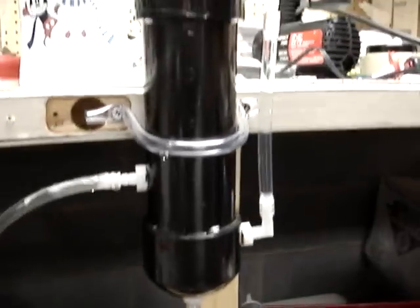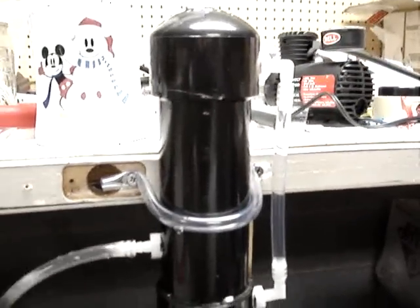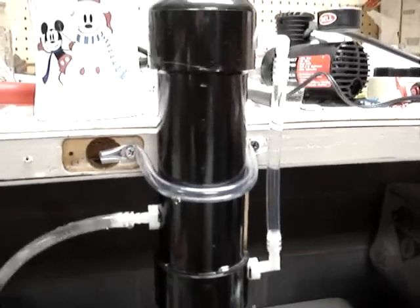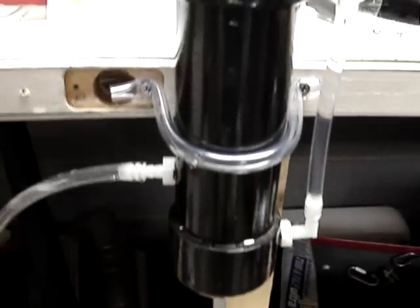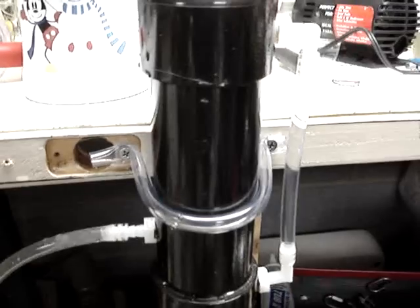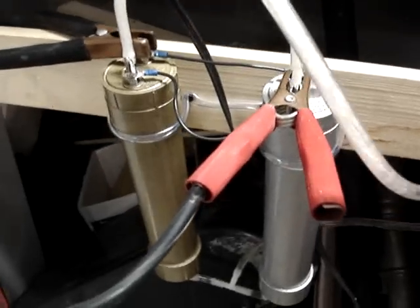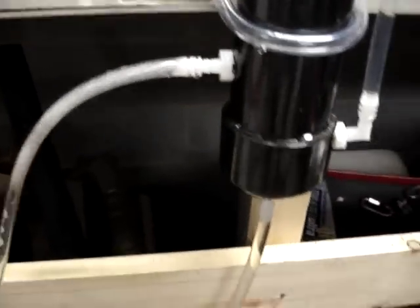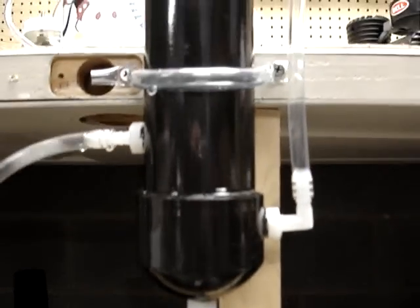Up here is a safety bubbler, and it serves two purposes: it maintains the fluid level with a sight glass on the side, and it also acts as a safety for flashback. In other words, if an ignition event were to occur, it would act as a safety valve for the two cells, thereby eliminating any danger of explosion.